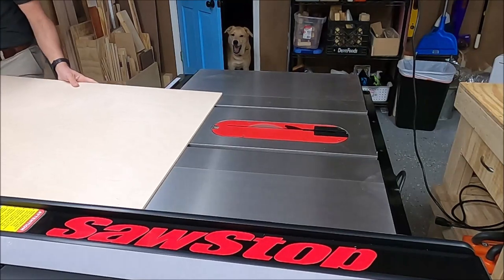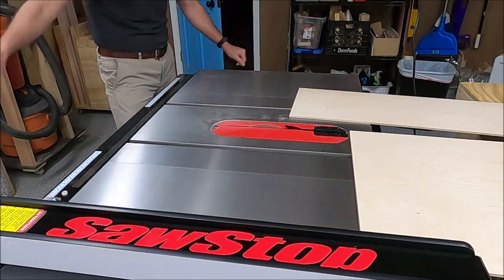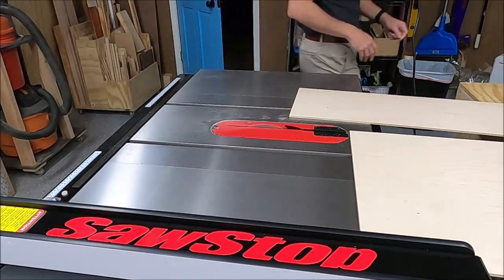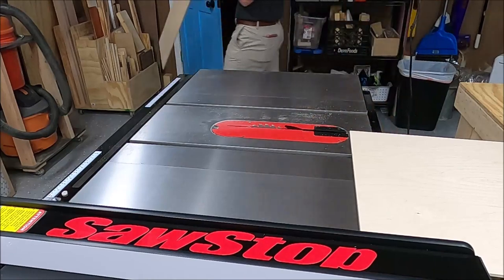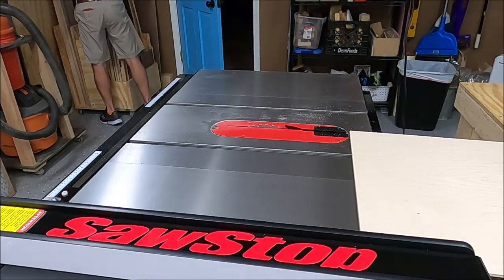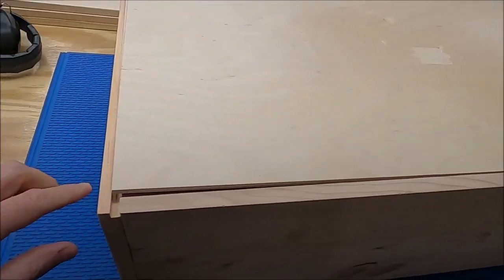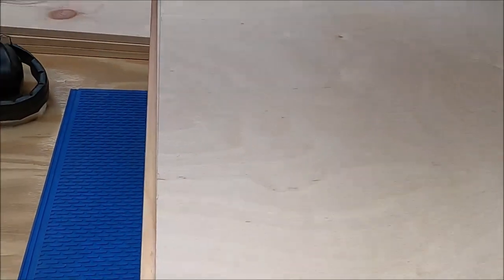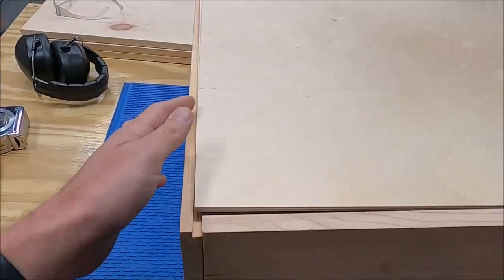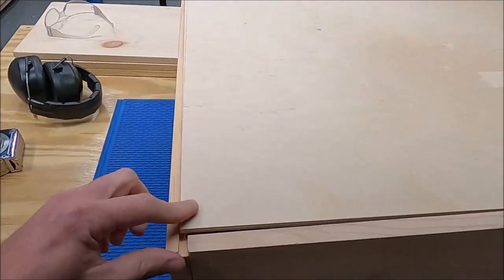I'm cutting down the quarter-inch plywood on the saw — there was zero resistance, it flew through there, smooth and awesome. I'm definitely not regretting that purchase, and there's some quality scrap to hang on to for the next project. If you don't have it square, when you cut a straight line it won't fit flush. I marked it so I'd be able to see where adjustments are needed — this part I'll just have to use the hand plane or sandpaper to get it flush.